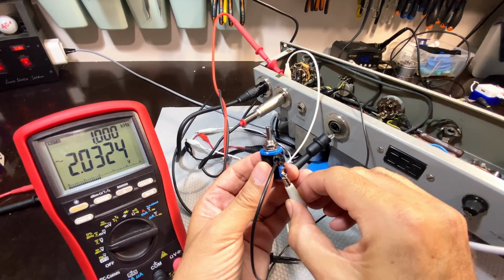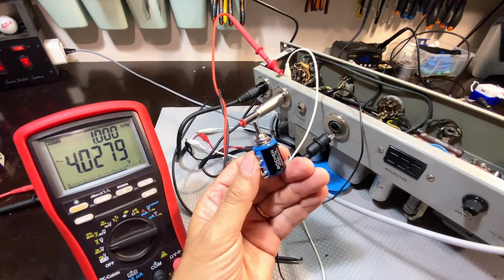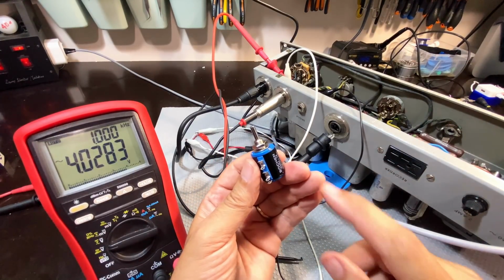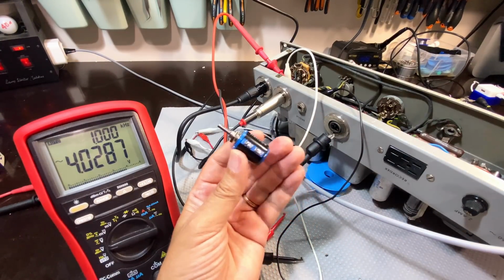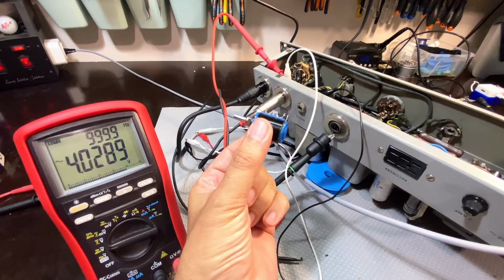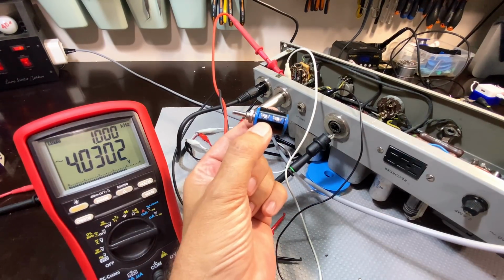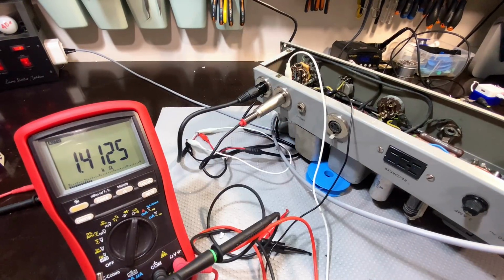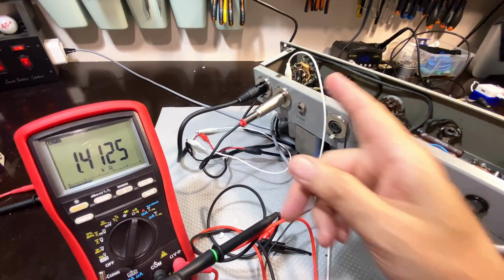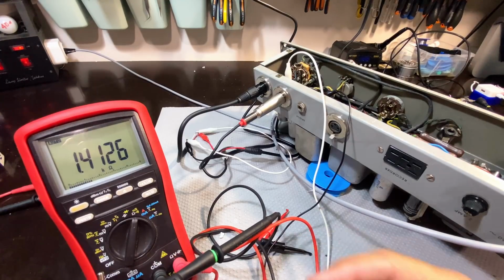Okay? So if I take that off now, and this is a pretty exact pot, and I did start with it on maximum. I don't want to short the output. I know that this thing contains the value, the resistive impedance value of that, what I'm supposed to load that with. So I'm going to measure this resistance now. So our output impedance of that system there is 1.5K, 1.4K rather. I'm going to load it with that. In fact, I might just leave this in there.